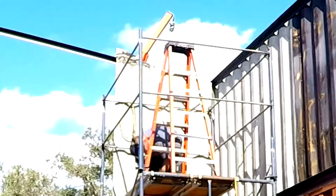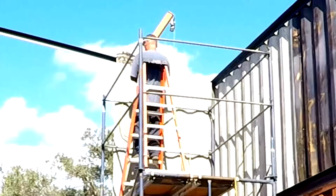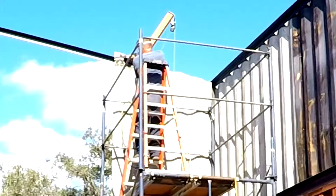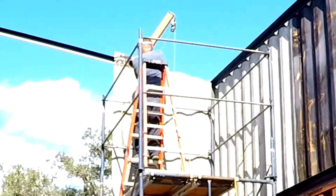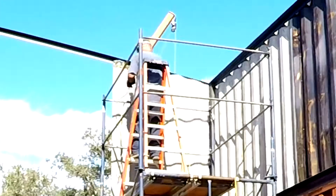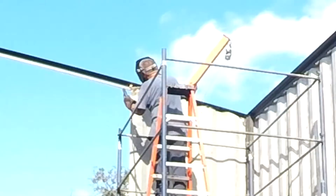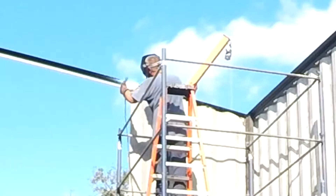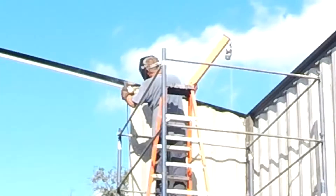Up top I go — I had to cut a little bit of the triangle off the panel because I measured wrong. This is a pain to measure. I was trying to use an electric measuring tool but we couldn't see the laser we were shooting up for the support point, so we used calculations and it went wrong. I cut the excess off — not a big deal, took a few minutes — then the panel went into place and I started welding it up. I tacked it initially, then finished welding the top and bottom. Just a couple of tack welds on the sides for now — we'll finish those later.